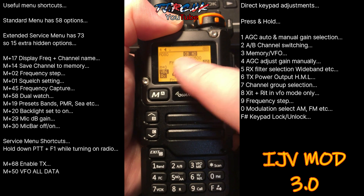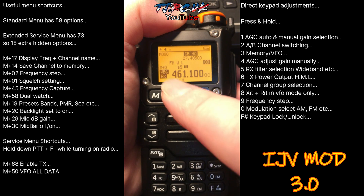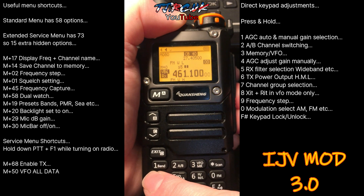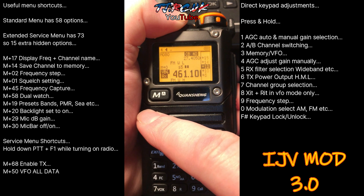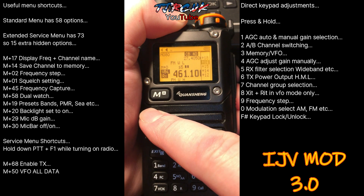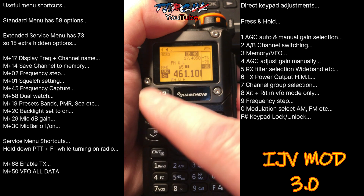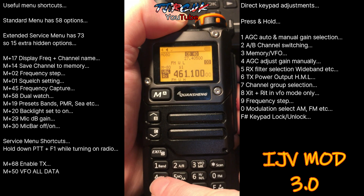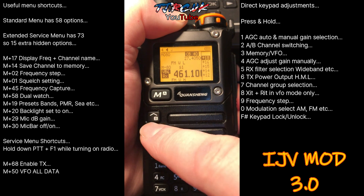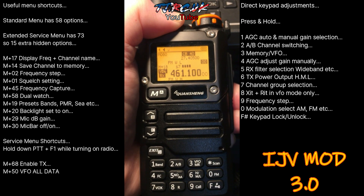Within FM you can only use manual from what I remember. Once you've got that showing, press and hold 4 and you can change your gain — it goes from plus 18 down to minus 80. On fast and slow, it's going to do the adjustment itself. So there you've got plus 18 — that's your automatic gain control feature.